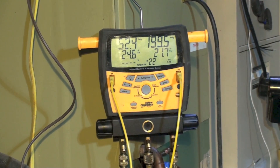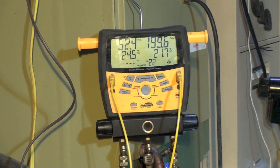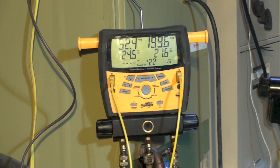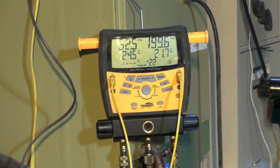I want you to look at this again. Notice our head pressure is about 200. When I added charge to this thing each time, superheat went down a little bit, but it stayed pretty much the same as long as that head pressure was around that 200-pound mark.